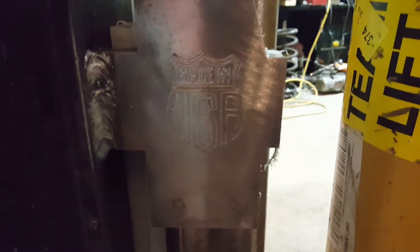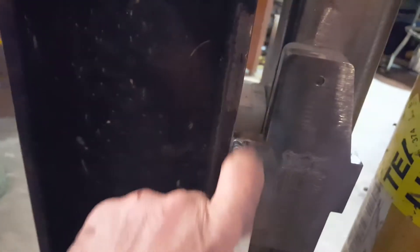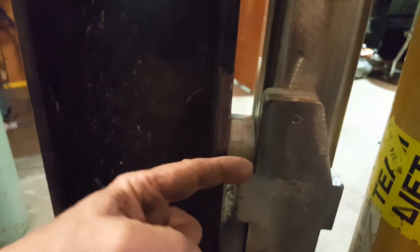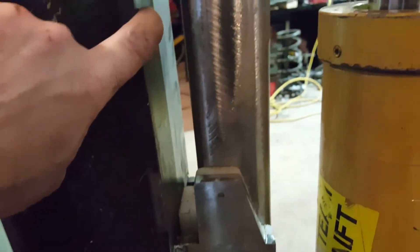Over here I have some little hammer-shaped guides that are backed by UHMW on the front and back. Along the edges there's also UHMW — drilled, tapped, and countersunk — so the smooth side rides against this beam as it goes up and down.